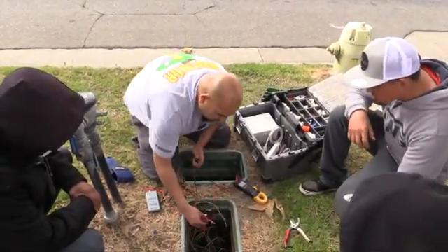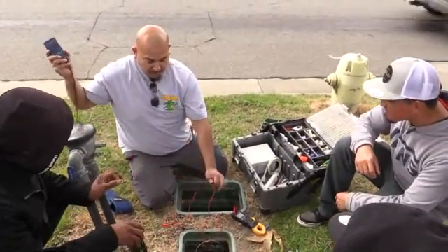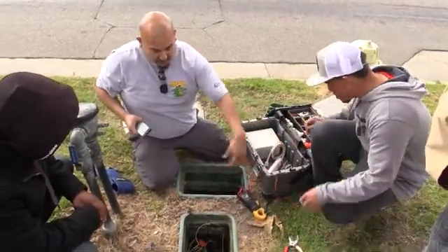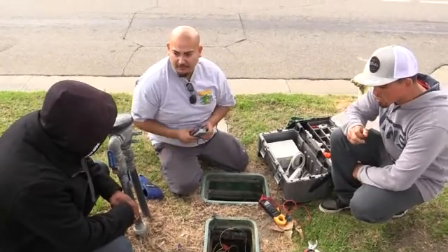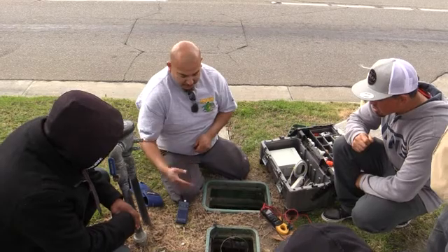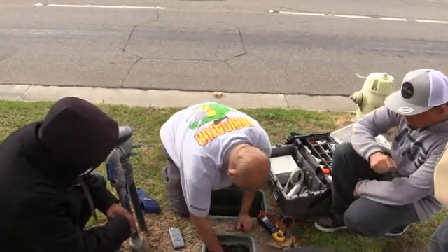When you turn on the station and your solenoid is connected, put the tester to it. If you're not sure you're getting 24 volts to the valve but you know which wire it is, you can verify 24 volts right there at the valve. And then you say, okay, let me check my solenoid. Once we verify we've got 24 volts at the valves, we can move on.